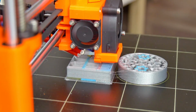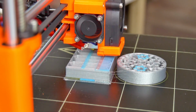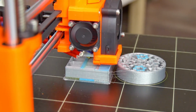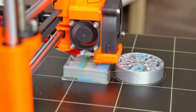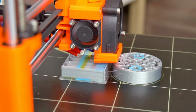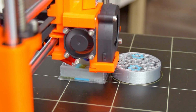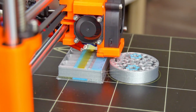So if there wasn't any more multi-material, would it still have printed that gray scaffold? No, it would not have printed that gray scaffold. It would just have stopped printing that priming block at all. It would have gone on with the print without printing any more of the waste pillar priming block, whatever you want to call it.